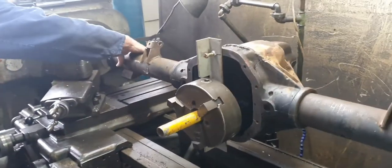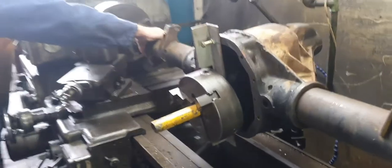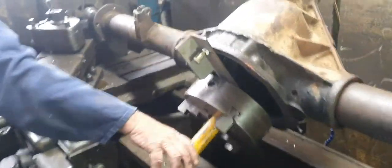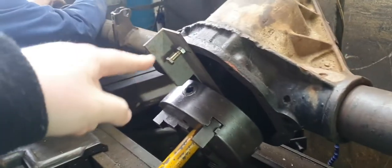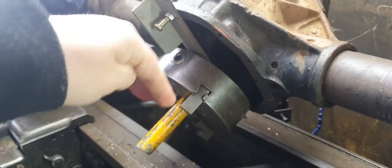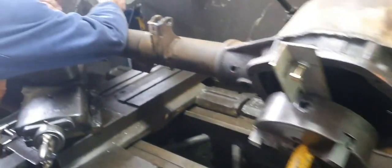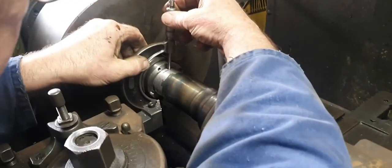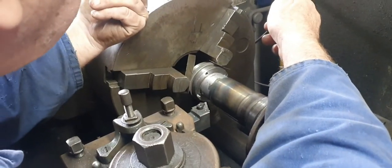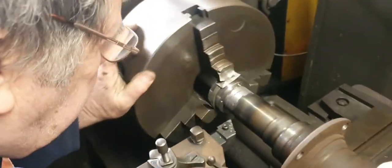Too far away now, this. That's a counterweight. You bolted it on, and you can move the chuck out and in by tightening and loosening the chuck to adjust the counterweight. Both there. Cutting pretty parallel. It's 12 thou up at the moment.